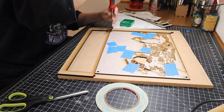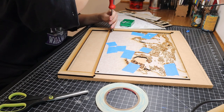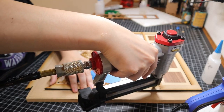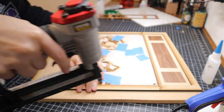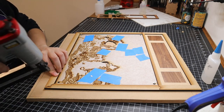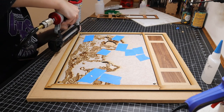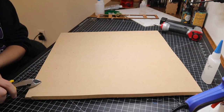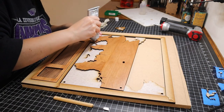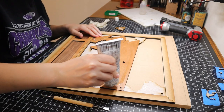Okay, round two. Using screws, I secured the land masses area first. This confirmed that all the pieces that would go around them would be perfectly square and exactly where they needed to be. I pin nailed in all the pieces with a tiny bit of glue on the backs just to make sure that they stayed. Using E6000, I glued down the land masses and re-glued all the little islands in place.